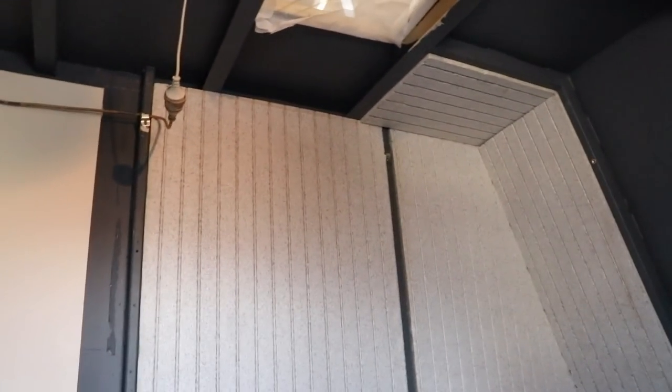So that's starting to partially insulate out that room. So that's a 60 mil covering of insulation. That's polystyrene that we're using. What we're going to do, you see that gap between the two where there's a blue or a dark gray line, sorry, that's going to have wood glued to it. And then that's what our wall panel is going to be fastened to. So it's about a 10 mil strip of, or what's that, 3/8 imperial. So roughly 10 mil of wood.